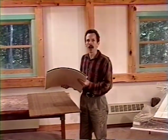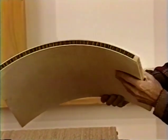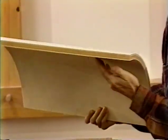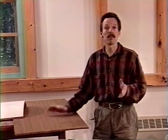Here is an example of a panel pressed with honeycomb. I have used 1/8" bendable plywood as the skin material. This blocking goes around the entire edge of the door, preventing the honeycomb from crushing on the edges, as well as to provide a surface for mounting the hardware and applying the edge treatment. The beauty of using honeycomb is that it's extremely lightweight and very stable. One thing to remember, this material comes resin impregnated and just raw paper. Use the impregnated type, since the vacuum press will crush the raw paper type.